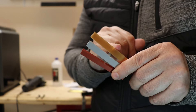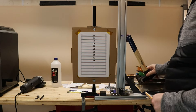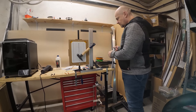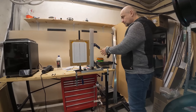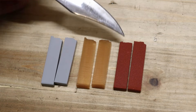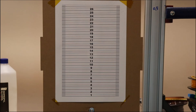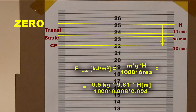The Izod impact test with notched test objects to see which is more brittle or tough. I am using the 1.5 kg hammer. PETG basic, zero position, then translucent, then carbon fiber. For the first look the break looks very similar in all three cases. Let's analyze the pictures to collect the breaking energy — this is the scale, the zero position of the hammer, and the edge position after breaking the three test objects. Measuring from the zero position I will get H, the difference in height, to calculate the breaking energy.